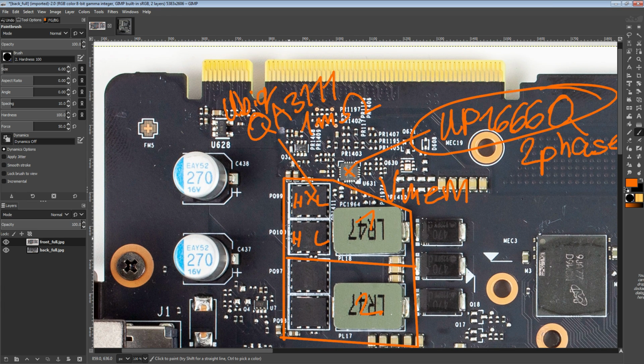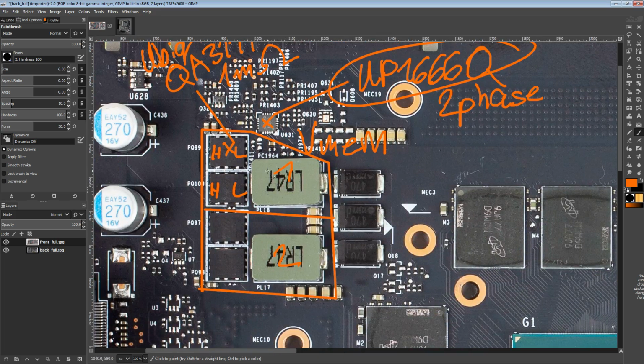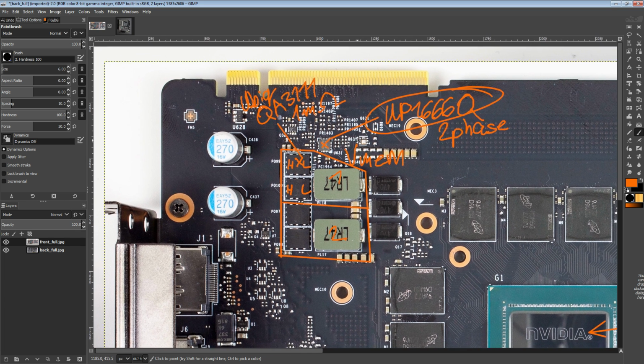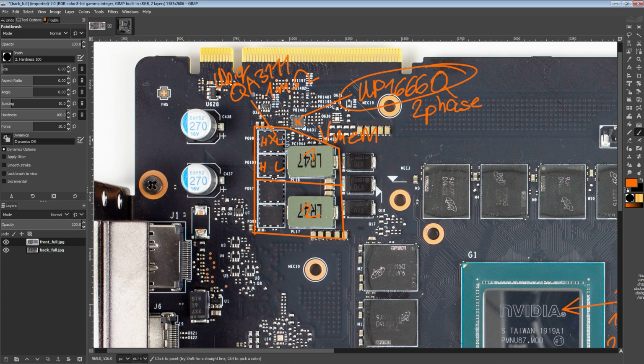And that's the main reason why MSI is using them for the memory VRM and not for vCore, because the memory VRM doesn't need to deliver anywhere near as much power as the vCore VRM does. So having slower, more inefficient dual NFETs doesn't really matter that much here, because you're not going to be pushing that much power through them anyway, so the power losses aren't going to be that great regardless, right? And they're still not really a downgrade over what you'd get on the reference card, because you just get a two-phase with, well, actually no, they are a downgrade over the reference card. It's just that it's the memory VRM. It doesn't really matter. This still isn't going to overheat. I have zero concerns reliability-wise here. It's just that these are cheaper dual NFETs.